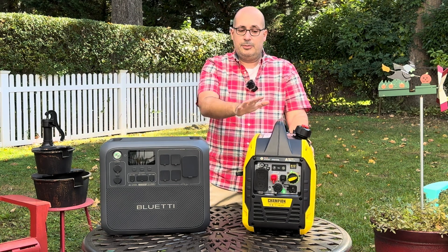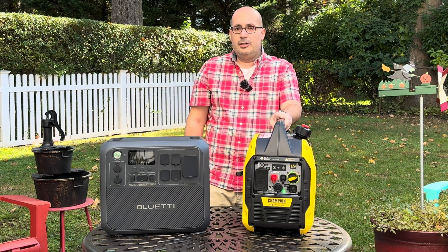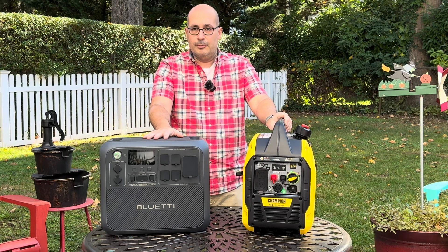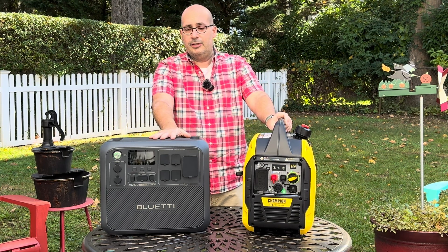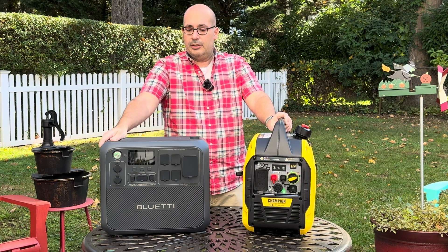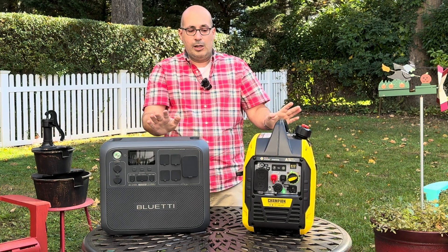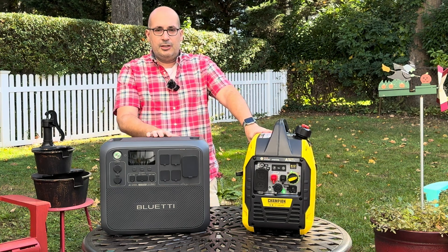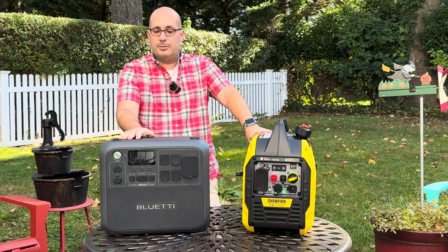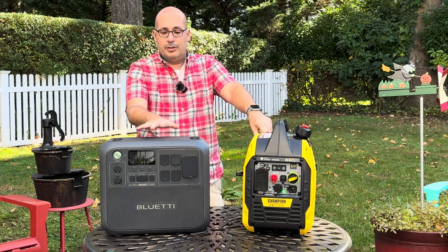You get very comparable power with both, except the gas generator lasts longer. But in a very bad storm — a hurricane, flooding, heavy rain — you're not going to want to use the gas generator outside. Whereas the solar generator you can put in the living room and plug in your fridge, or in the kitchen and plug in a light. There's a lot of flexibility in where you place it. The gasoline generator always has to be outside, well away from a structure, and well ventilated. So if you can afford both, I'd say both is the best of both worlds.